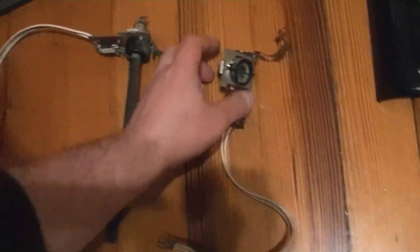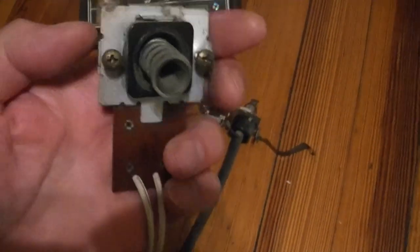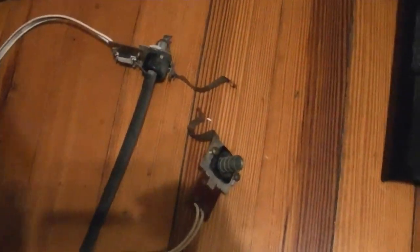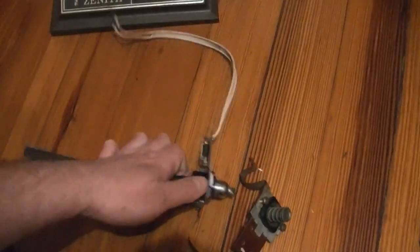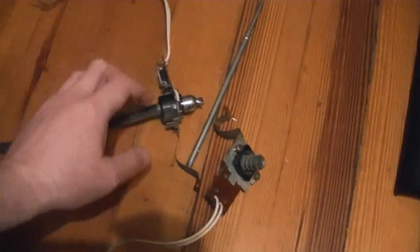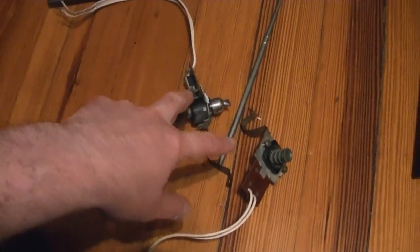Here are my two patients. These are both from Tandem Sets and both damaged. This one's telescoping antenna is almost completely gone — all that's left is a bit of the base, a spring, and broken-off plastic. This one has a bit more of it. What happened to this one is the telescoping antenna got flexed back and forth a few times, metal fatigue set in, and it just snapped right off. I think the diameter is right, and it sure appears that both of these will transplant perfectly. My Holiday and all three Tandem Sets will have very nice antennas.